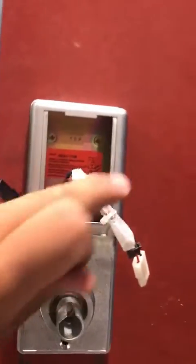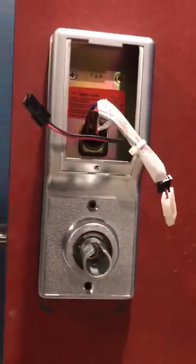Another problem I sometimes run into is these holes here don't match. So what I do is I take off these two screws just gently and play with the plate, move it up until it lines up. Then you have these small screws that go on the side of this assembly right here. Undo those two and play with the plate just a little bit, then tighten it up when everything's on there. The plate is still a little loose, and now I'm going to insert the other screw — see, it's perfectly aligned. Nice and easy, you don't want to force it because they'll break. These two screws will break if you do it too hard, so tighten them up nice and tight.